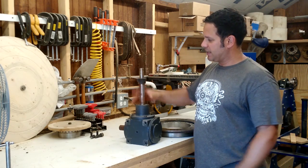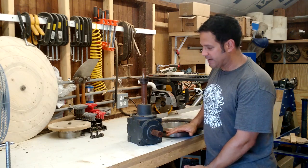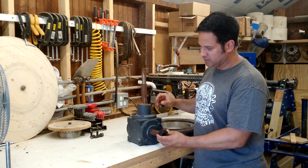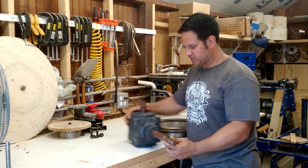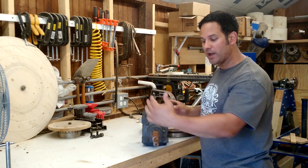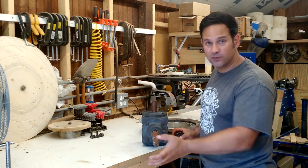The idea was that I had this board and I needed the reach because I had a lot under this table. Things are different now since I'm adapting this for the vertical lathe, and I'm going to have to bore this out again to fit onto this side. This gearbox is going to sit like this with this gear on it, and it's going to engage the ring gear. This gets me far enough away where I can have either a motor with a pulley or a hand wheel.